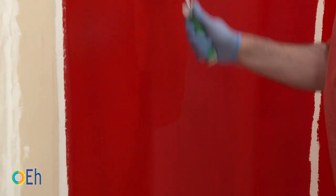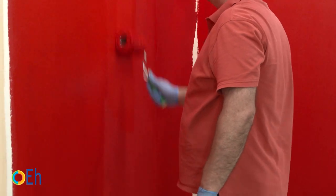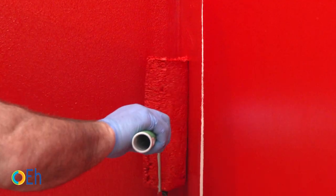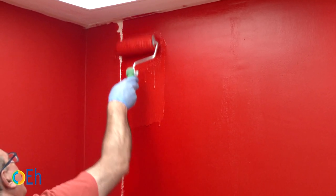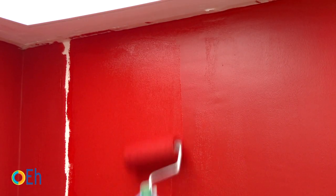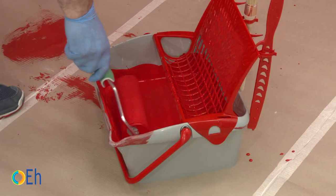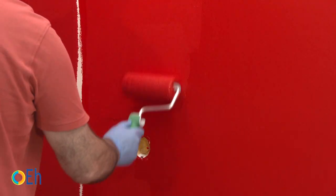When you paint with intense colors, it is important that you always use high quality paints, because it is very easy when you wash it or with any friction to take off part of that pigment, and then scratches are immediately noticeable. We now apply the second layer on the satin wall. You see that the application is simpler here — having the first layer already applied, we spread the paint much better. As the surface is mainly composed of resins, the satin paints are very washable and the brighter, the more washable they are. The brighter a paint is, the harder it is to tear out pigments from the surface because they are always protected by the top layer of resin, which is the one that also gives the shine. Don't forget that you also have intermediate solutions such as semi-matte paints.